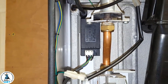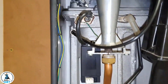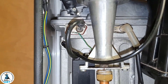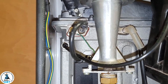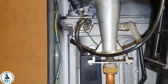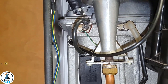So if the spark generator is okay, the next step would be looking at your electrode or your sensing device. While you're on the electrode, you can remove it from the main heat exchanger and check the spark gap — see if it's the correct size. If it's disfigured and there are big gaps, you're not going to get a spark and you won't hear it, so you need to observe that.